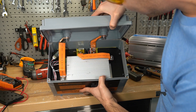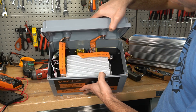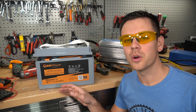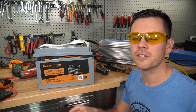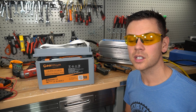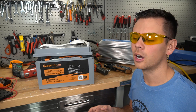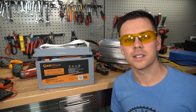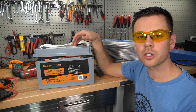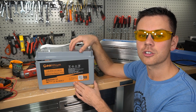It actually pulled it off. I was scared it would cut off because I didn't reassemble it perfectly enough, but it works really well. Even though we can do it, I would not go over about five minutes. If you're running a microwave, you can totally do it under five minutes. If you're running around 150 amps, which some small microwaves pull, you could easily run it for 15 minutes with no serious increase in degradation. This is also very useful for surge capacity — if you're trying to run motors and have multiples of these in parallel, you can run some pretty large loads.